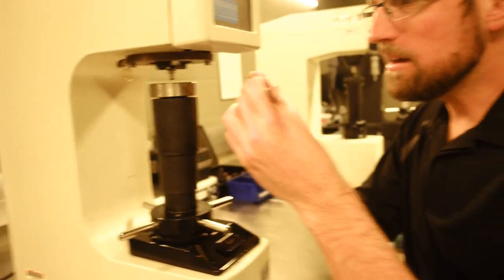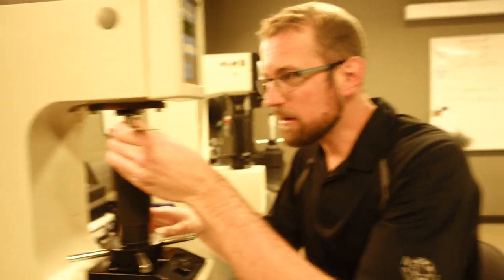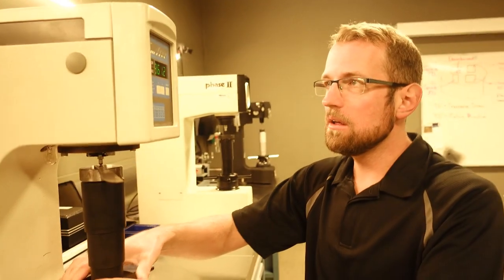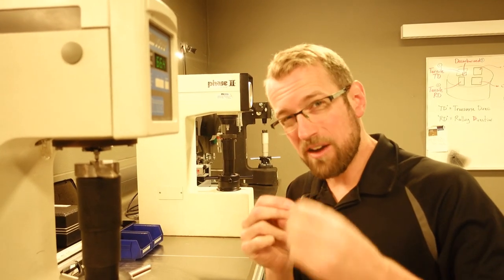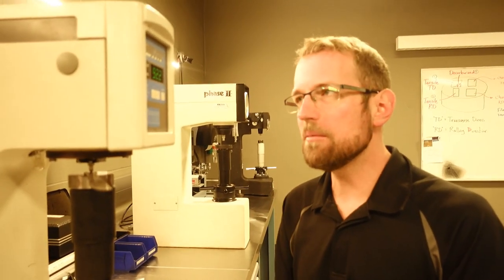92.4, about the same. We're not getting that in this case because the ferritic stainless steel that we have here never actually changes its structure as we heat it. The whole reason why regular steel actually does see that change at all is because at high temperature it changes its crystal structure. And when we quench it and force it to change back really, really quickly, it kind of locks everything in place and traps all the carbon.